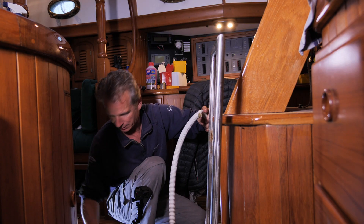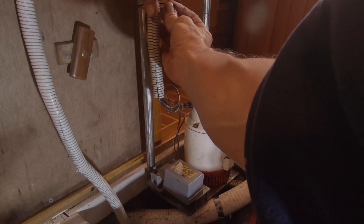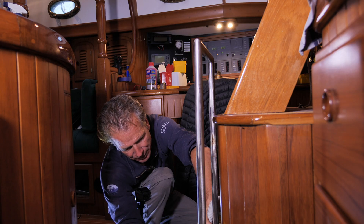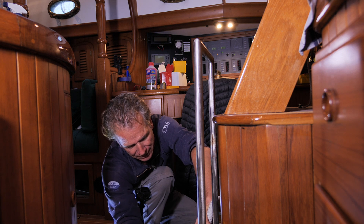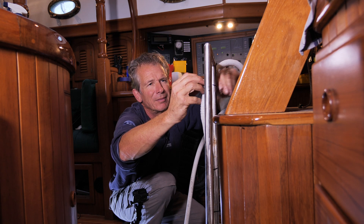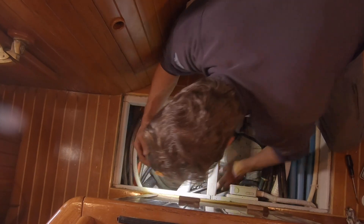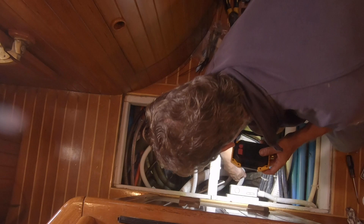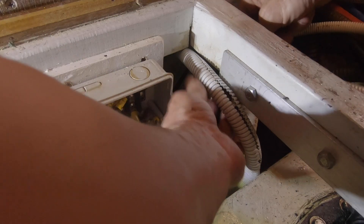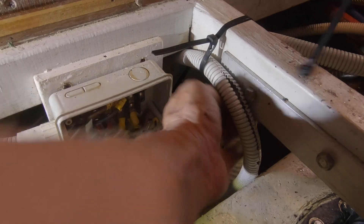What I'm going to do is clip this with cable ties all the way up the arm here, so that the joint we've made is as far out of the water as it possibly could be if we ever do get any water coming in. And lastly I'm just going to bring a loop of the cable up in there as strain relief, so it's not constantly pulling down on this connection — just tuck that in nicely.